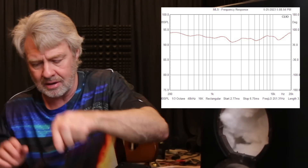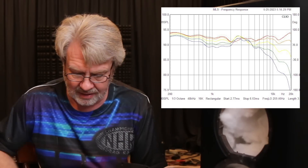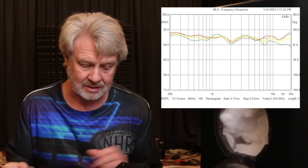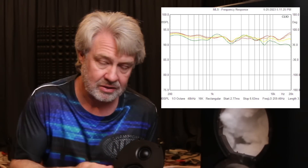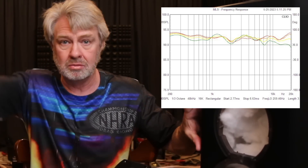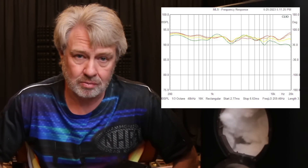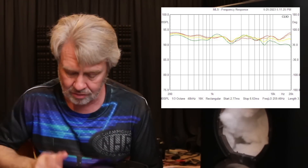We also did a measurement with the grill on — it's a little rougher in the response right where the grill is. Looking at the horizontal off-axis, it drops off evenly and pretty smoothly, staying a little proud in the 3 kHz region, which is not unusual — overall looks good. The vertical off-axis looks great, and a lot of that has to do with this tweeter-mid pod. They're keeping this in phase over a wide range and the acoustic centers are really close. By the time they cross to the lower woofers above and below, it's at a low enough frequency — around 800 Hz or less — that it's not causing issues. At those wavelengths you don't see a big shift in phase. So over a wide coverage region you're going to have the exact same sound, and the in-room response should look really good.